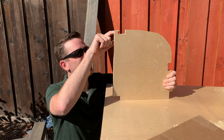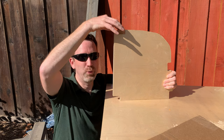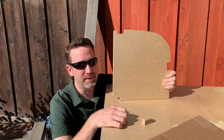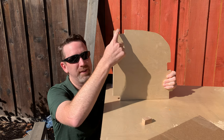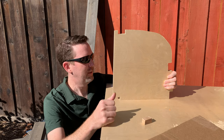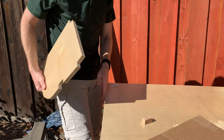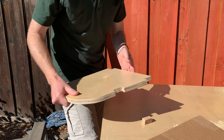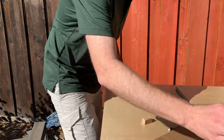The additional piece is I have these notches here to hold my 1x2 pieces of wood, and this is going to create the ribs in the framing of the cabinets and create a lot of strength without adding really any weight to it. So you can make sure that these notches are in the exact same spot for each one, which is important from a continuity standpoint. I also am using the corners of my wood, because I get two 90 degree angles. I know I only have four corners, and I'll eventually have to use the middle, but right now I'll take advantage of them. I've already traced this with my pencil, and so now it's time to cut.